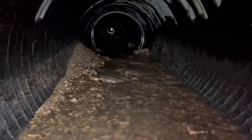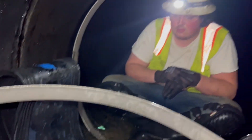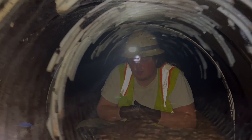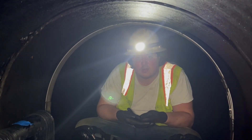The pipe has a previous liner that has in some portions become compromised. If the ribs of the seal itself are on top of one of those compromised portions, we use Pro Stick — that way there's that padding. We have some expanding filler loosely positioned with the bands over the rubber.